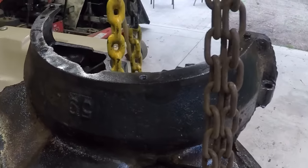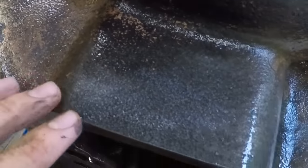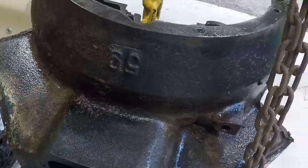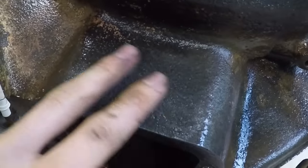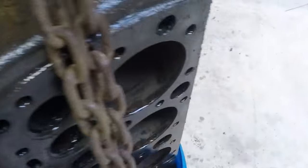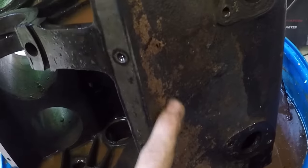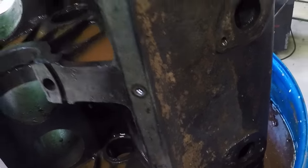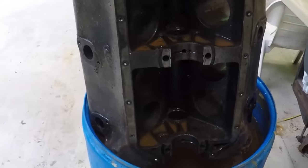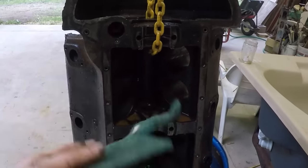Well, this seems to have worked really well. Right here I just rubbed it with this Scotch-Brite pad and rinsed it off, and that's bare metal right there. You can see here some paint that was over here and that just comes right off. All the grease seems to be loosened as well. Over here this was like rust or paint or something, and you can see that comes right off now. I think this looks pretty good. I'm going to take this out now and pressure wash it and rub it down with this pad some more.